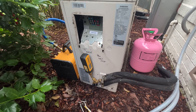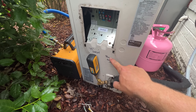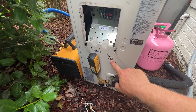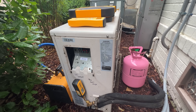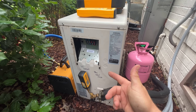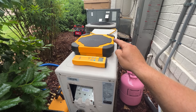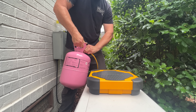The decay test went well. As you can see here — 75-foot line set, total 48 ounces. That's total charge: condenser, everything. I wrote that down years ago whenever I installed this, and thankfully it makes my life a whole lot easier. So now I'm just going to go ahead and break the vacuum with 48 ounces of some fresh R-410A.